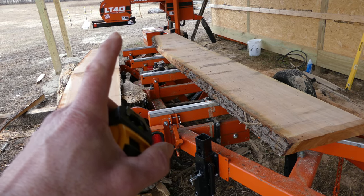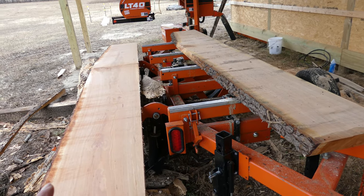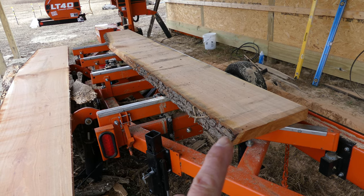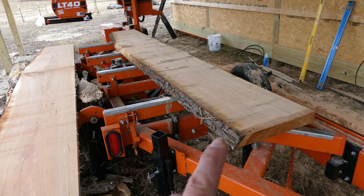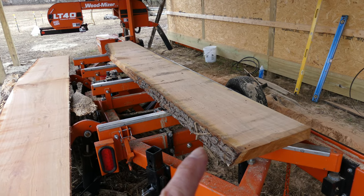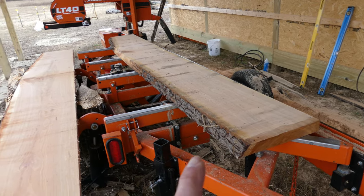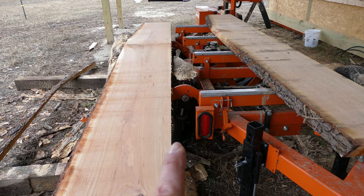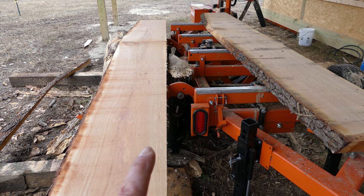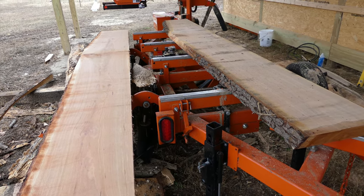So I'll go down and set the mill for the exact same thickness as I just cut that and shave probably about a quarter inch of wave or any discrepancy off the top of this one, which has all the dirt and the scratches on it anyway. And then we'll flip that one over and mate it up with this one, and then we'll have our bookmatch countertop and we'll get a shot of that. So again, hang tight.